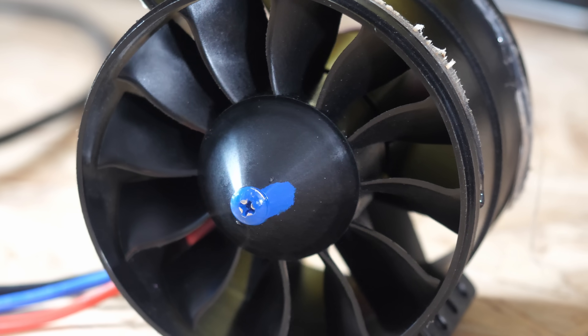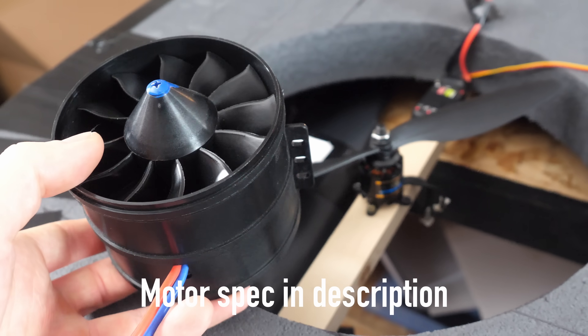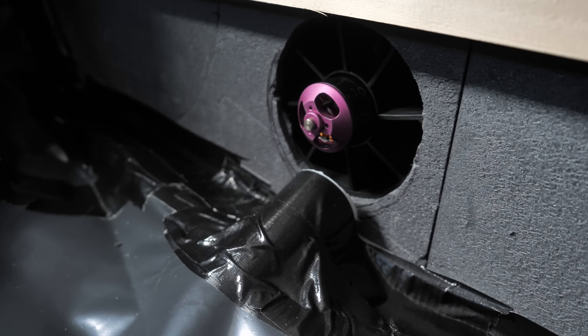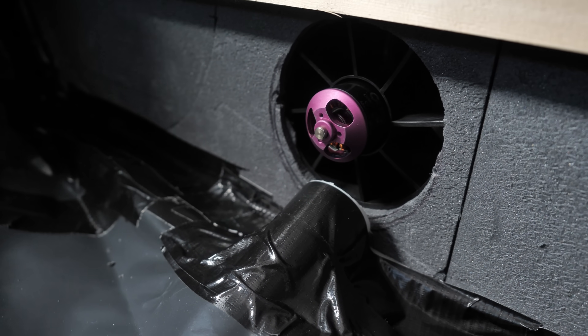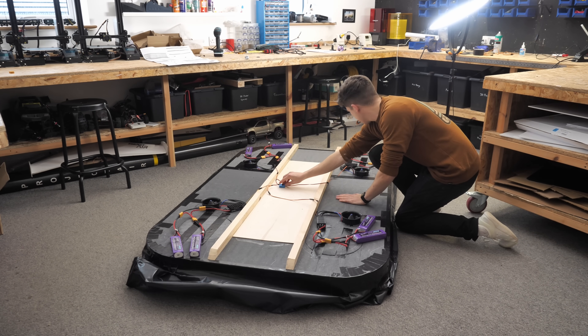However there are a few problems with that: first of all it's a bit dangerous because these propellers are very close to my face, and second of all a propeller is not as cool as an electric ducted fan. Individually these things produce three to four times the amount of thrust as one of these motors with a propeller on it. I installed the fans and the intake ducts for inflating the donut skirt, which were now made from PVC pipes, and then got ready to test them with my full weight on board.